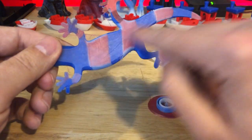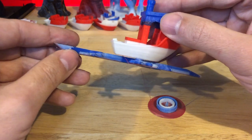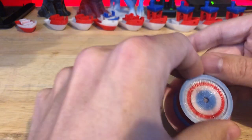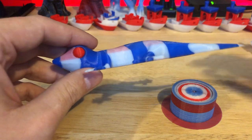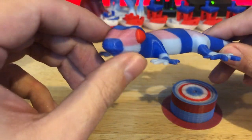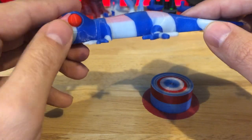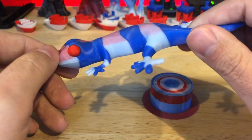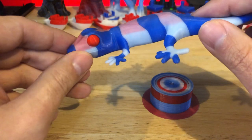I was watching it purge. When I saw the first layers coming down, the bottom layer wasn't too worrying, but then I realized the white isn't exactly white. So I canceled it - apparently it's not purging enough. I decided to try 40 millimeters. It looked white on the printer, but when it got to the red eyeballs you can see what happened - it just bled. Apparently 40 millimeters wasn't enough. It's purging basically after every layer - coming here to purge and then going back again. How much more filament do I need to purge out of this? Since they're sharing a nozzle you've got to purge all this filament out.